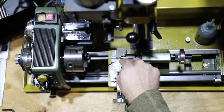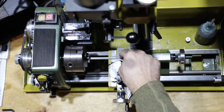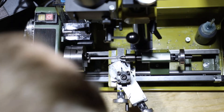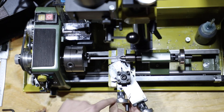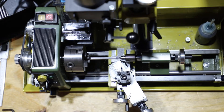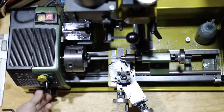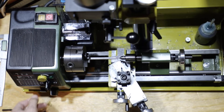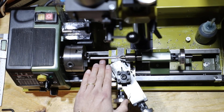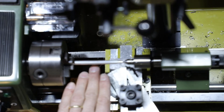I haven't moved the starting position from where we stopped cutting last time. I did do a little bit of a chamfer off the front. Checking — it looks like we're at the same location. I'm going to go ahead and zero this on the compound. This is all tight now — I've got that bolt tight, I've got the belt tight. We're going to close it back up and I'll adjust the camera focus to make sure we're in the right area.